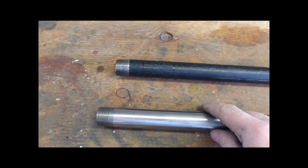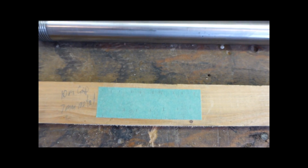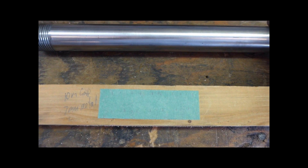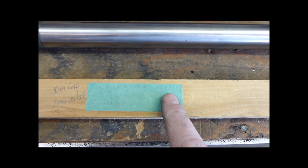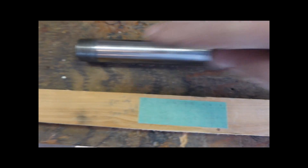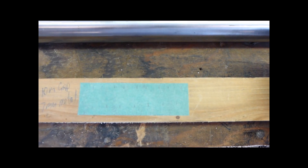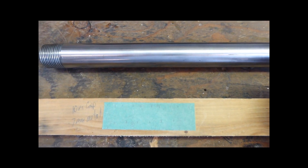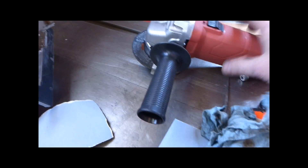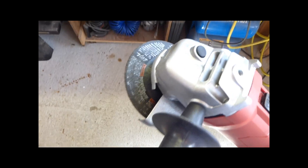This end here is where I'll screw a fitting on to run the orifice pipe down through — I'll show you that later in the video. Right now I'm going to take this tape — I've wrapped it around the three-quarter inch burner so the ends met, then straightened it out and put equal marks along it. I'm going to wrap it around the burner again and mark those positions on the burner tube. Then I'll take my angle grinder and put a cutting wheel on it.